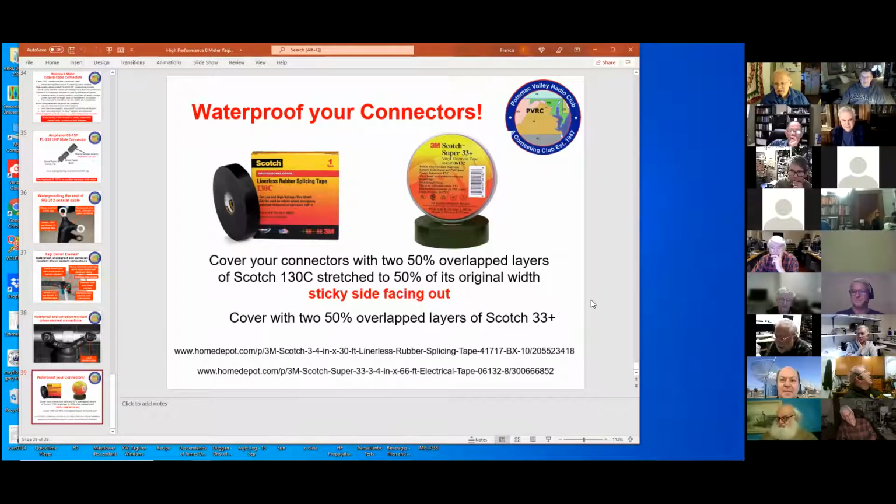This is Rich K on HTV with another 2 antenna question. I plan to put up a second 7-element Yagi. I've got the first one at 40 feet, and that may not be the final location for it. I do now have an OK2ZAW stack match, which will be installed in the spring. The question is, what would be the heights for the 2 antennas using equal length cables? I heard that you recommended not putting the stack match box at the top of the tower, to avoid having to climb the tower. So it'll probably go on the bottom with either equal lengths or properly equal phase, so we have that extra half wave. What would be the optimum heights? I was planning on spacing about 19 feet.